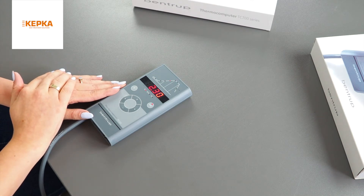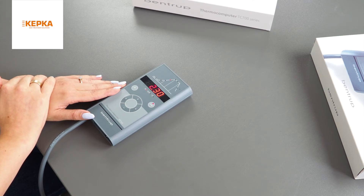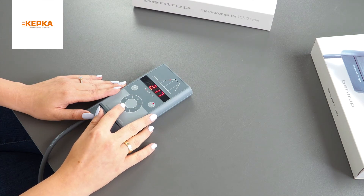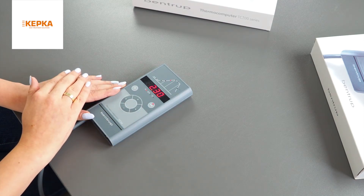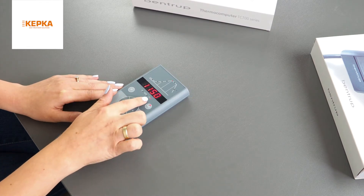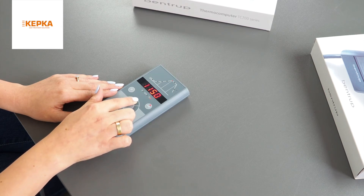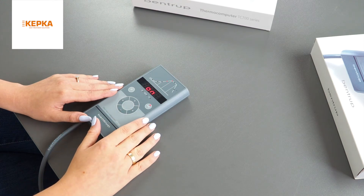The next step is setting up the time during which my kiln will arrive at the maximum firing temperature. I can use the skip option or adjust the time manually. My maximum firing temperature in this example would be 1150 degrees, which I can adjust with the plus and minus keys. In this segment I want my damper to be on.